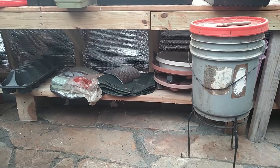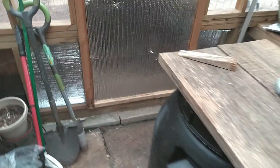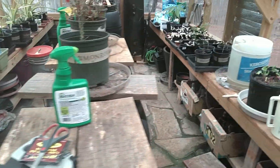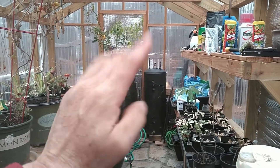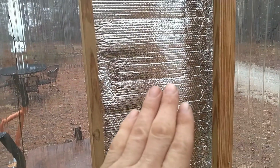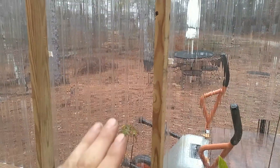We went through and bought some rollout insulation — it's really thin, about a quarter inch, so the R-value isn't very high, but it did help. We spray-foamed all the cracks in the blocks, siliconed the gaps, and tried to minimize all the air leakage. We closed the door completely off for the winter and insulated it. We also put some insulation in the north wall to see if that would help — it probably did a little, though we didn't do it all so it didn't help significantly.